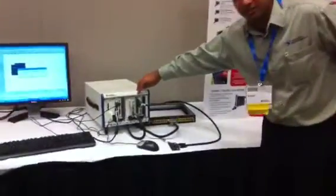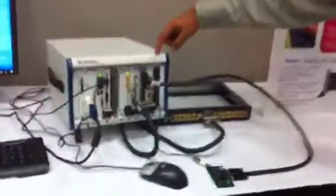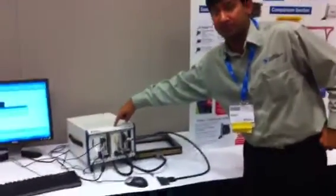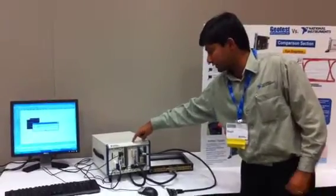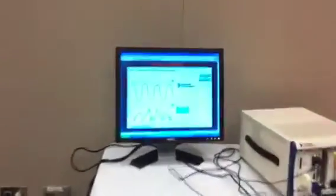Now I do have a couple of demos here. I have the GeoTest 5292 here. I'm using their cable and their terminal block and feeding it into a PXI-5154 high-speed digitizer. I also have the PXI Express 6548, which is a high-speed digital I/O module that we provide, capable of 200 megahertz clock rates.